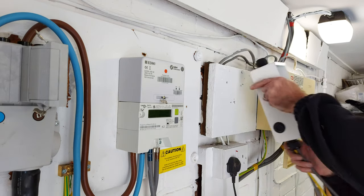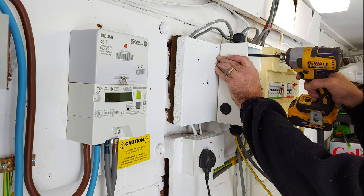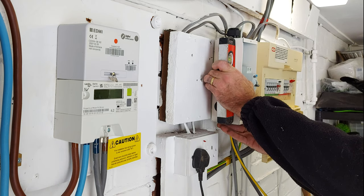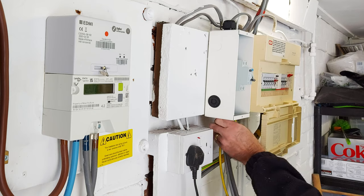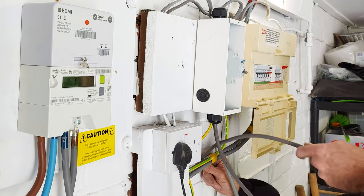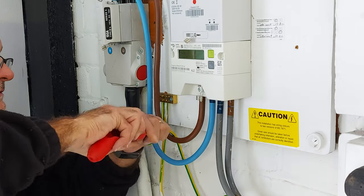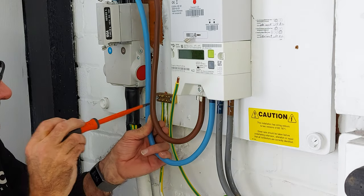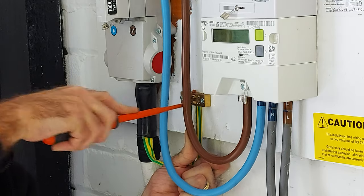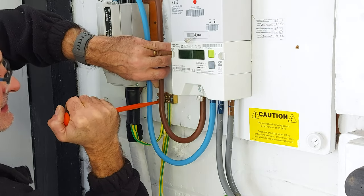Time to fix this little bad boy. So I'm gonna go about there. This is 10mm earth because we've got 16mm tails. That satisfies the adiabatic equation for anyone that's interested in knowing. I have to be careful with these because sometimes I snap the head of the screw off over tightening them,